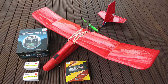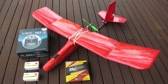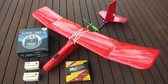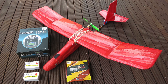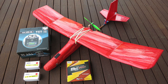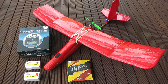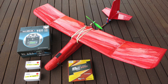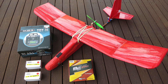In this photo you'll see my recommended gear for a beginner. Number 1 is the Turnigy TGY i6 programmable transmitter for about $70 or so. It's got a 20-model memory and you can do mixers and all different sorts of programming — it's a wonderful radio. It even has a limited amount of telemetry, and it comes with a receiver that has two antennas for diversity, so it has great range.